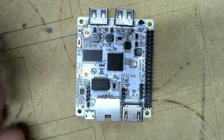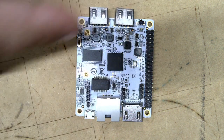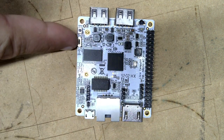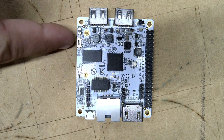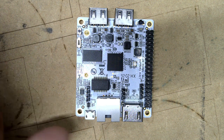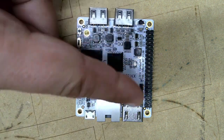All right guys, this is the board. I'll do a quick walkthrough - you've got two USB ports here, the u-boot button, your eMMC switch which you want to make sure is switched up to eMMC and not NOR. You've got a micro USB, ethernet adapter, HDMI, your 40-pin header, and a couple of other ports including an IR receiver.